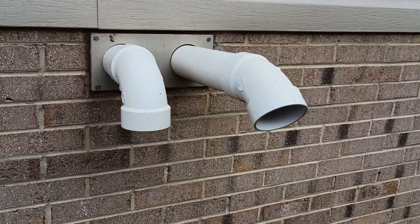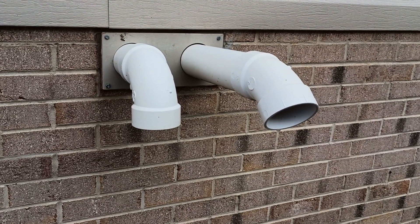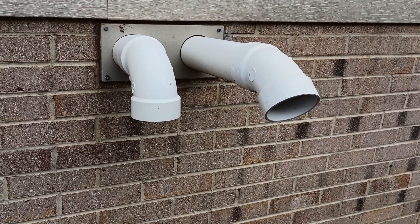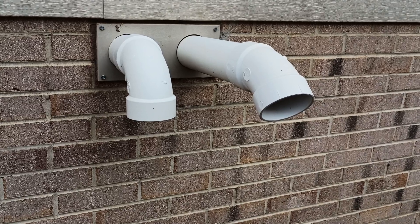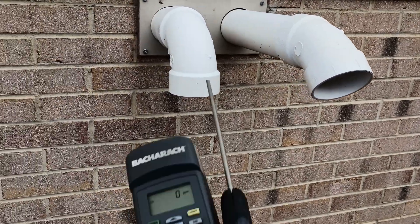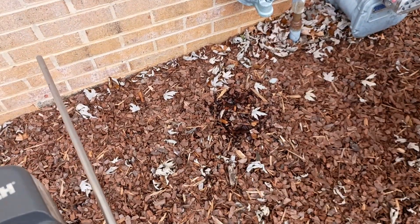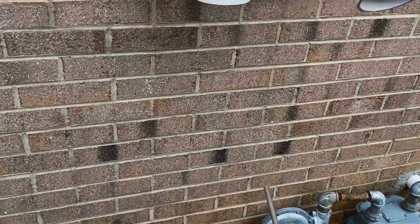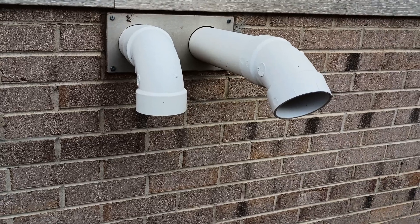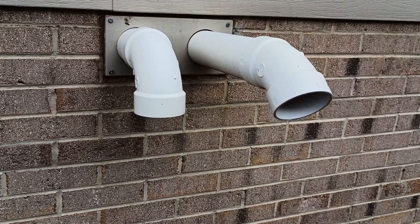You can pop up through the scuttle hole on a roof, and if there's an RTU up there with a bad heat exchanger and the wind's blowing your direction, you'll smell it right off the bat. I always say this thing is burning ripe — something ain't right. A lot of times you'll see a black ring around the pipe. This is our intake, this is our exhaust — you see little water droplets dripping off, making a wet spot on the ground. The best way to find out whether you have a bad heat exchanger is to insert a probe and check the CO.